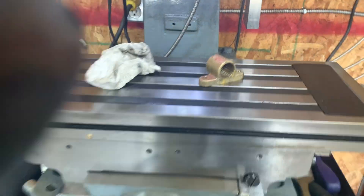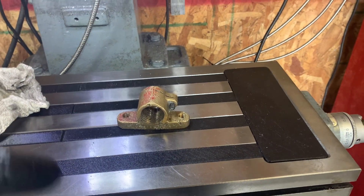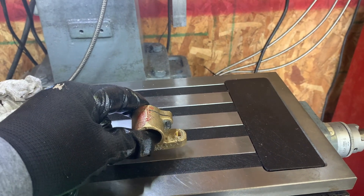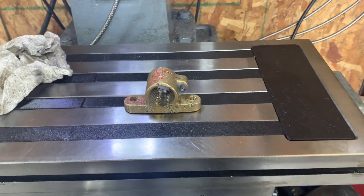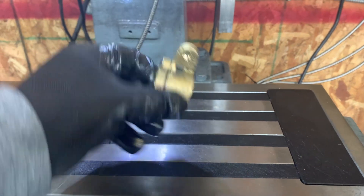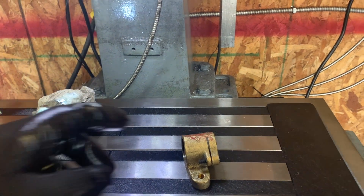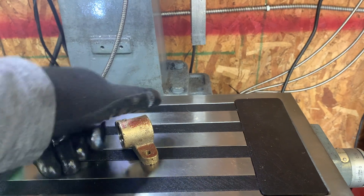Well, as I'm reassembling my mill here I discovered why. If you look at this nut, the tightening bolt for your threads — that's for the backlash relief — is here. Well, mine was installed in this fashion. As it turns out, it needs to be installed this way.